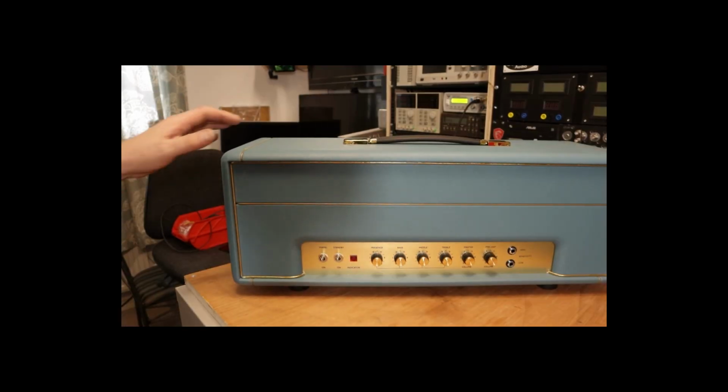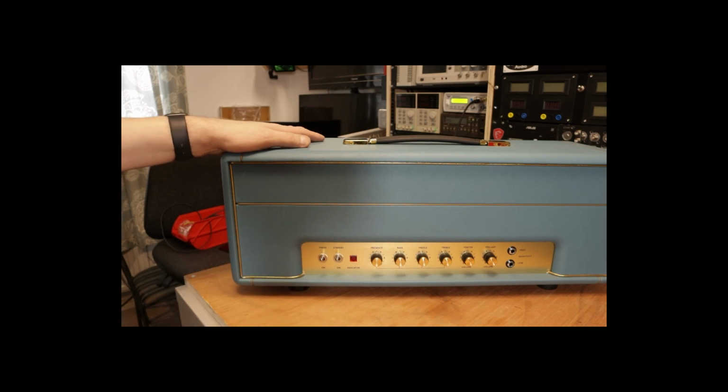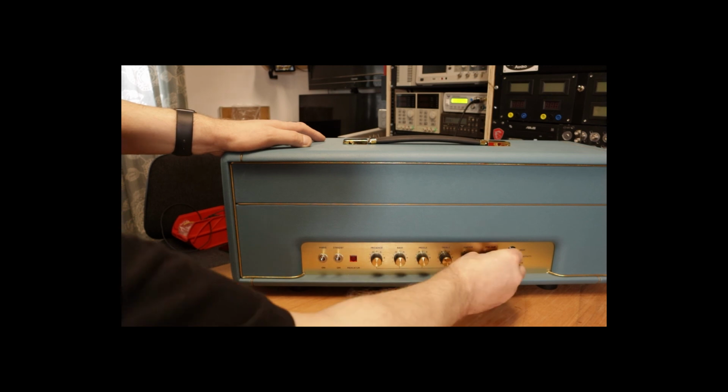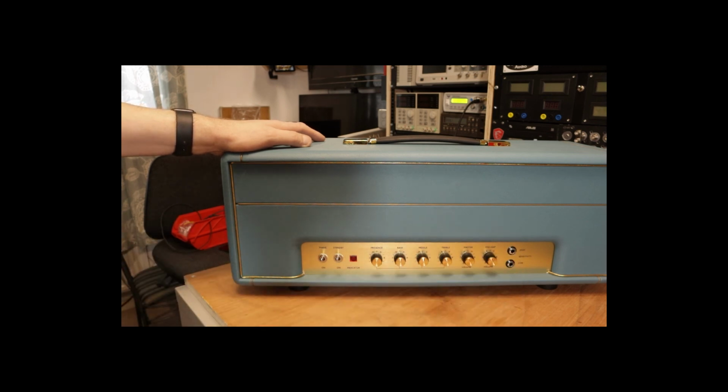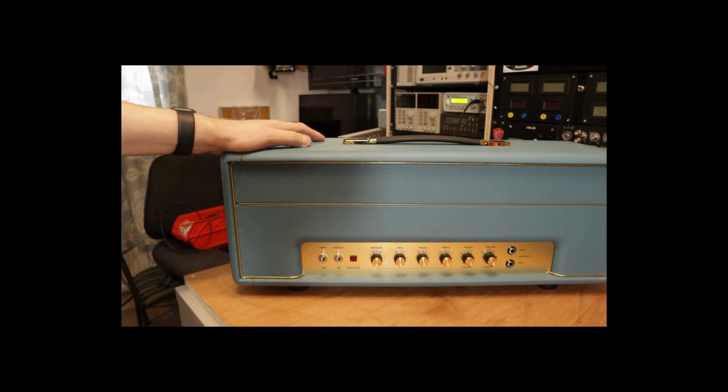And this is the amp now put together. The amp as standard would have had the bright cap in place, and really I would have preferred to have had it so that with all the volume knobs in the correct positions, the bright cap was in the circuit, rather than pulling it to switch it on. I'd rather it be on in the other position.